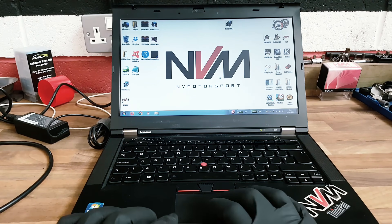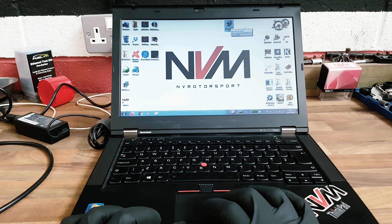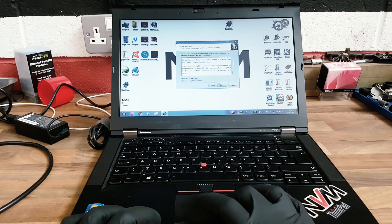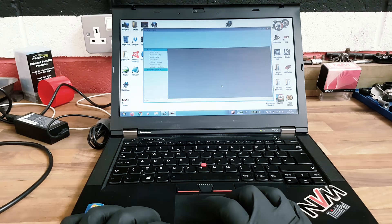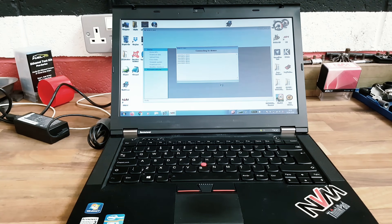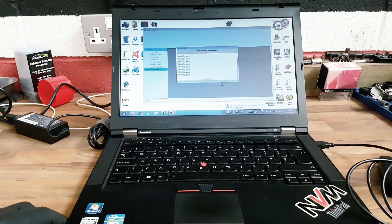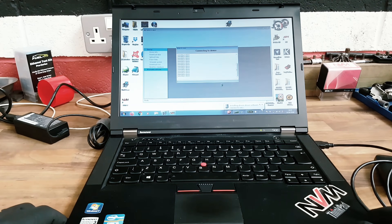All you need is a Windows PC or a laptop. Double-click on the setup file, the NVMR.exe, that we email to you when you purchase the NVMR Flasher. Double-click on it, follow the instructions, agree to the terms and conditions, and install on the C drive. Now that's launched the software. Within the box you would have got a USB cable, and that USB cable connects into the top of the NVMR. The other side connects to the USB port of your laptop or PC. Once it's connected, it will install the device driver software itself and then connect to the associated software.